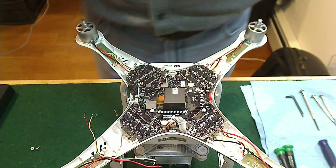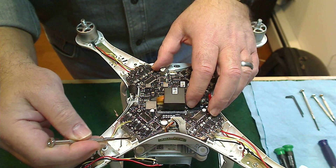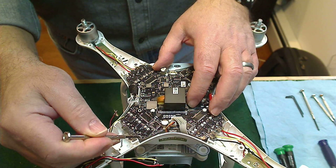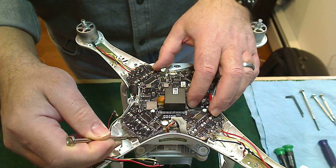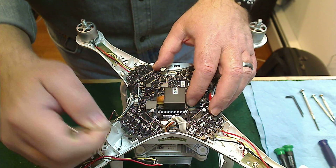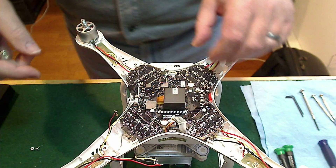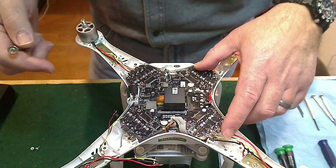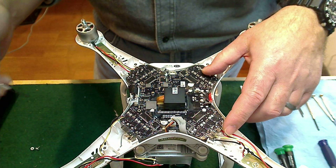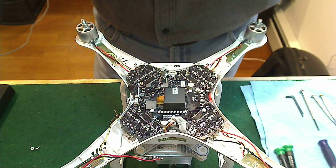When you get the unit, the wires are actually coming up through slots in the board to keep them down, and DJI puts a bead of glue — looks like a white silicone — across the wires to keep them in place. I don't think that's particularly necessary; the solder should do the job, and these slots in the board seem to be pretty good at holding the wire.